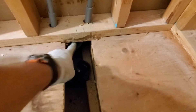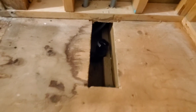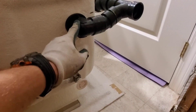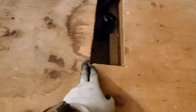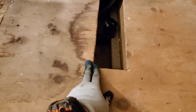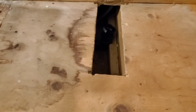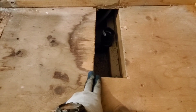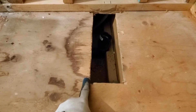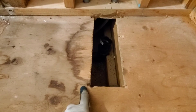This mark is the center of the drain for the tub, so I'm going to offset 22 over. One thing that's very important: make sure this drain fitting is not sitting on the plywood. If it's sitting on the plywood, as people step into the tub or you fill it with water, that's going to start moving the drain up and down and it will develop a leak. I'll cut this back a little bit more, but make sure your drain is not touching the subfloor because you're going to run into a problem.